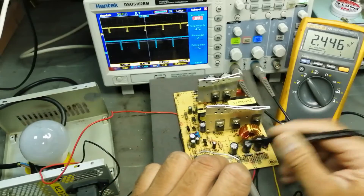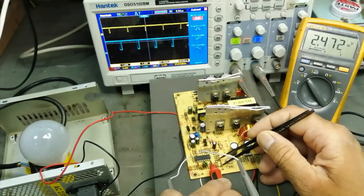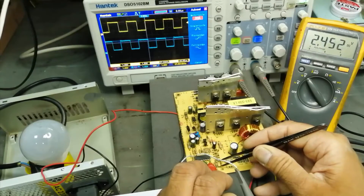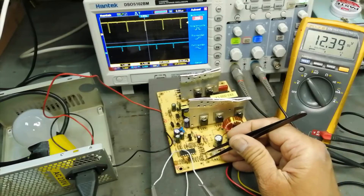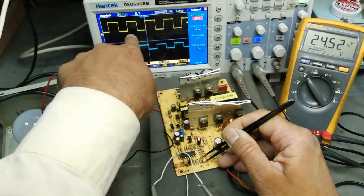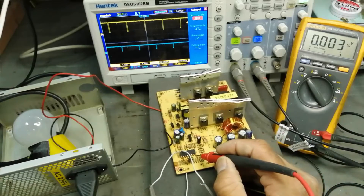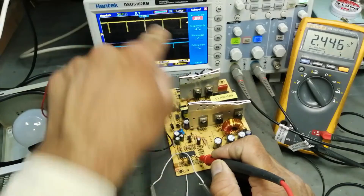When this pin goes low, we can see it on the oscilloscope. If I make just a jumper to this resistor we can see the level of pulse width modulation — now we can see more clearly. If we change this resistor we can increase the current. I am taking 12.39 volts, and if I change this reference our power supply will reach 24 volt. At this time it is switching at full 12 volt reference, 5 volt reference at pin 15 and 16. At 2.4 volt reference it is switching at this level.